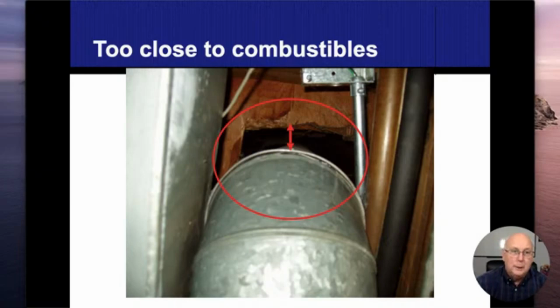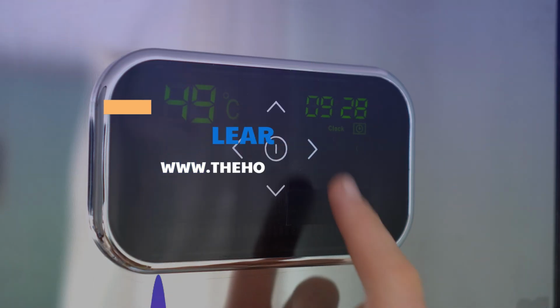All right, they're there to be overly cautious, overly protective. When they set up these numbers and these clearances, it's not that, well, we want to reduce the chances of a house catching on fire. No, we want to make a logical clearance distance where there won't be any chance that a house will catch on fire. Because of which, I'm kind of a stickler when it comes to these things. Anytime I see combustible materials such as the refrigerant lines, non-metallic cable wiring that comes in there, any sort of insulation that could be anywhere, wood structures of the material, if I'm within 6 inches, it's getting photographed, it's getting documented, it's going in our report. All right, that's my 2 cents.